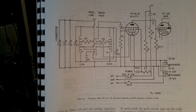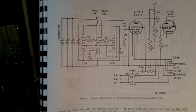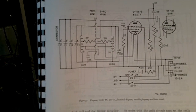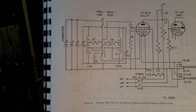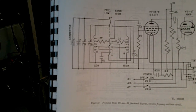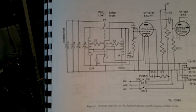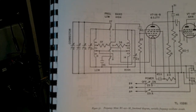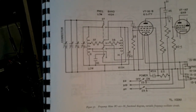This is the schematic of the switchable VFO that covers two ranges. It is actually a Hartley oscillator, but very interesting — it has two taps on the Hartley coil instead of just one. The bottom tap goes to the cathode connection and the top tap to the grid connection. There are two parasitic suppression resistors, 37 and 38 on the schematic. This is a very sophisticated style of Hartley oscillator and extremely stable compared to the conventional circuit, which uses only one tap.